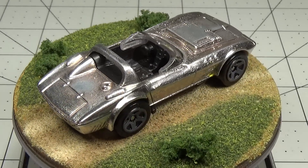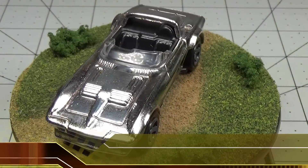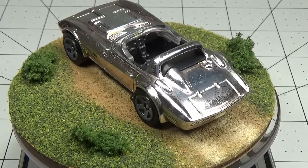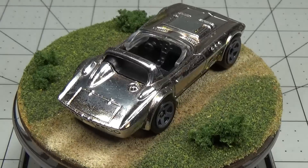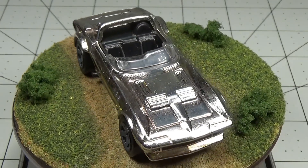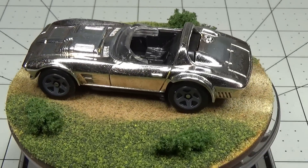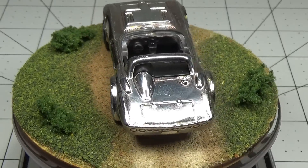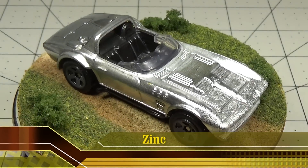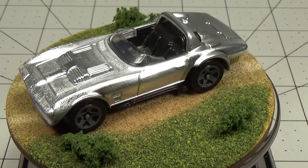So what are my thoughts on these kits? The copper plating is definitely worth the price. Plating these cars in common copper salts like copper sulfate won't work because copper sulfate is corrosive and will dissolve your car before any copper is plated onto it. The copper solution used in this video is not corrosive, so you can plate directly to the diecast. These chemicals must have brighteners and conditioners in them because they plate to a mirror polish — if your metal is polished, then the plating comes out polished. Most homemade plating baths can't do that. Last, the copper is going to come in really useful when soldering diecast.